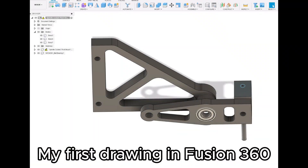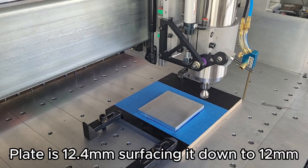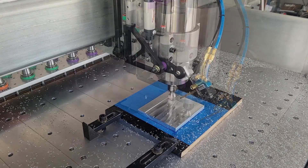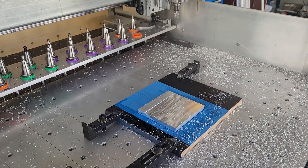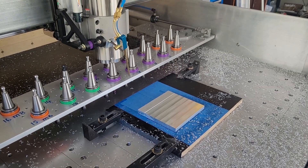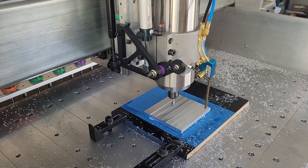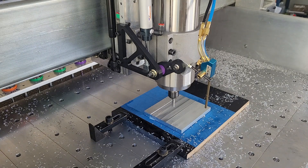Okay, let's get started. This coolant nozzle should swing down and mist coolant will start. So the nozzle swings out of the way and the spindle goes to home position. Dropping off surfacing tools, picking up a 2-flute 8mm. And there's the clearance to the nozzle on the tool bed. And so now we'll start the 2D adaptive pocketing operation.